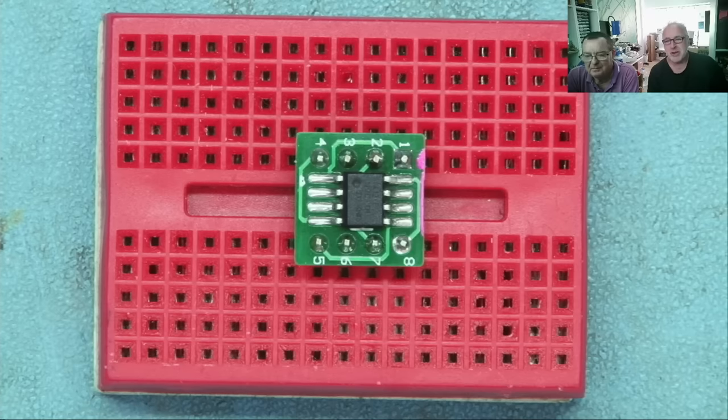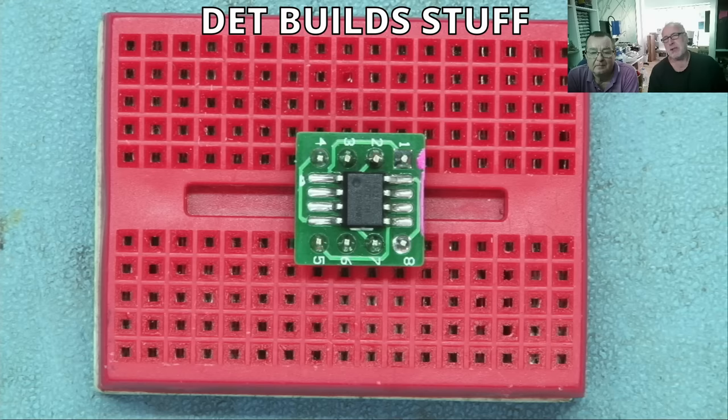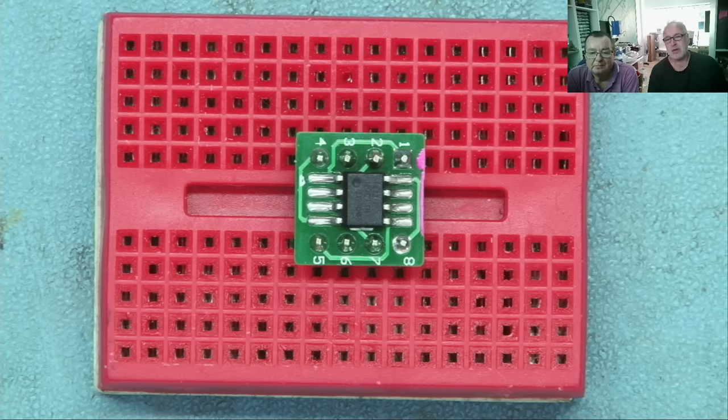Of course, we're going to need a little CPU for the whole project. Mr. Bleep worked with an ATtiny, so I'm a fan of these UPDI things. If you watch my channel, you maybe have seen a video about UPDI and how easy it is to program with these. So I thought, use a little CPU over here. This is an ATtiny 412. When I tried to compile some basic code for the OLED display just to test if this works, the compiler was laughing at me, because I tried to compile a program of 8K into this little 4K CPU.